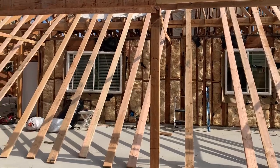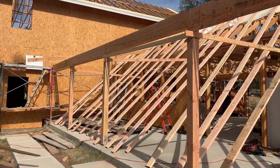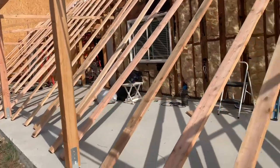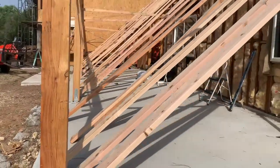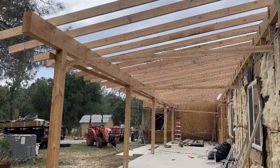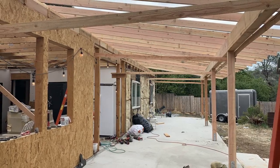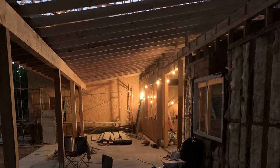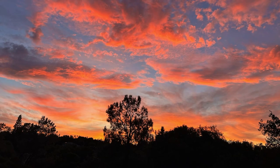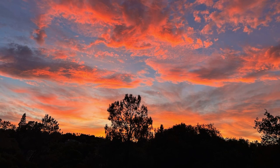I wasn't here for this part, so you're going to see some stuff my dad did. He laid out all of the 2x6s that will make up the framing for the top of the porch — these connect those horizontal beams back to the rest of the house. In the next picture you'll see all those 2x6s installed into place. The bracing is still up to make sure everything is dead straight and level, but once we were comfortable with that, the bracing came down. Now that the roof trusses and porch framing are in place, the next step is to add sheeting. Thanks for watching — we'll see you on the next one.